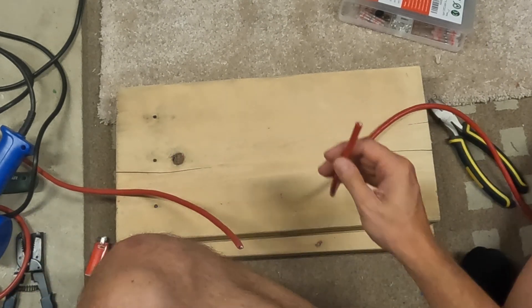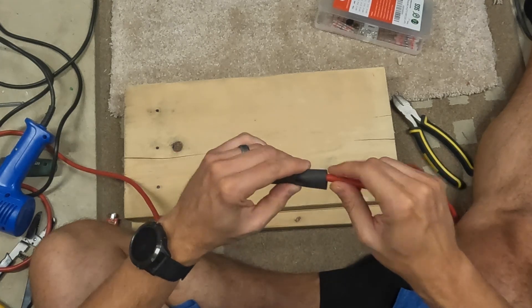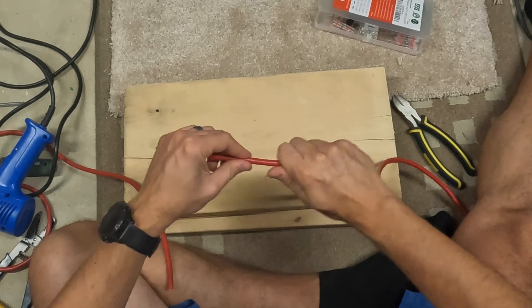One thing I want to do here is I also have some additional heat shrink tubing, and I'm going to put this over top to act as the external coating of the extension cord. Even though I'm using the solder heat shrink connections on the wires themselves, this is just that extra little bit of security. Now that I've cut the cord, you've got to slip this on now — because if you don't do it now you're going to have to cut the cord down the road, or destroy this in the process. So let's just pop this on and run it down to the end.